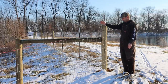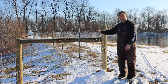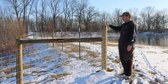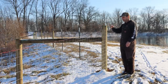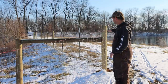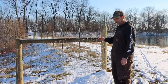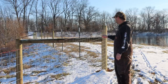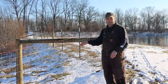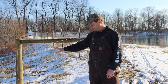This here is the corner brace we built to stretch the fence around at about a 45-degree angle. A lot of people weren't happy with me putting a corner brace here and stretching around it — many disagreed. So far the brace has not moved and still looks good, but the fence itself is the loosest fence that I have. I do think it caused a lot of drag trying to stretch that fence around that post, making it harder to stretch tight. If I was to do this over, I might just go ahead and make this two pulls. I'm not really happy with how loose the fence is in this area.